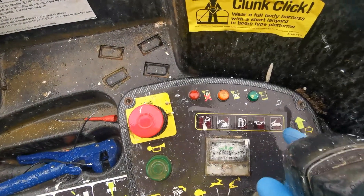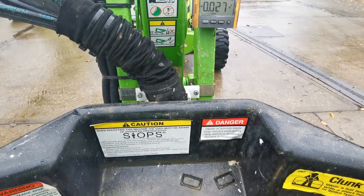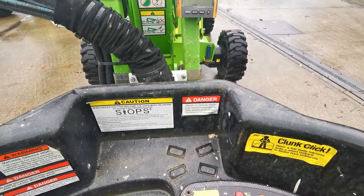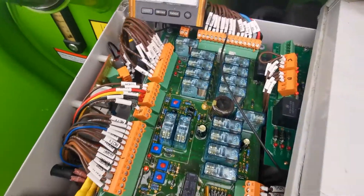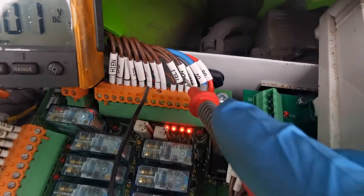It goes into the elevator drive depending on how much I had the telescope out, and I have no voltage on it. So it's two switches that are controlling the high enable drive - the telescope and the booms down. To have fast speed drive I need to have power on the booms down wire.